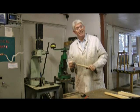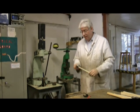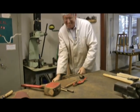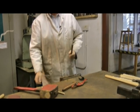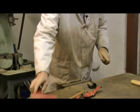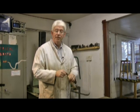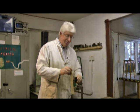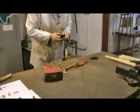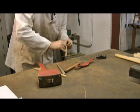We've got this fairly tightly fitted, so the question is how do we get it out? If you're lucky enough to have a fly press or an arbor press that makes it easy, but it's not all that tricky. You can put it back in the vise - this time holding the head in the vise, not the handle - and with a piece of wood or an old hammer handle I should be able to knock it out. I'm confident I've got the handle the right shape and size, so I'm going to smooth it round a little bit with some 80 grit abrasive paper to make sure it fits well to the edges of the eye on the head.